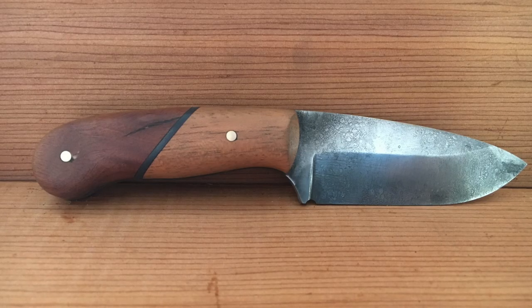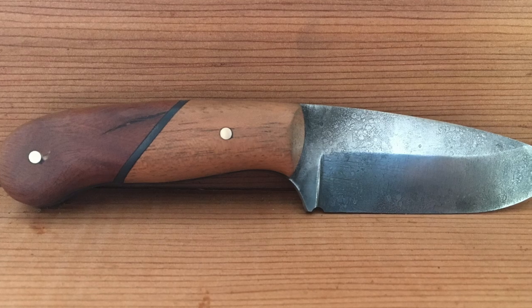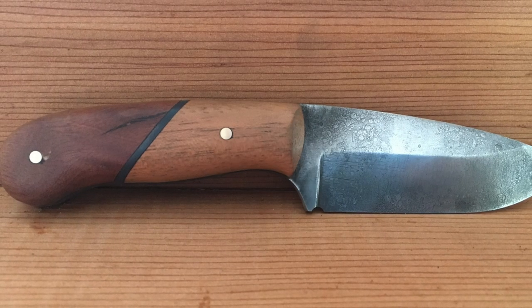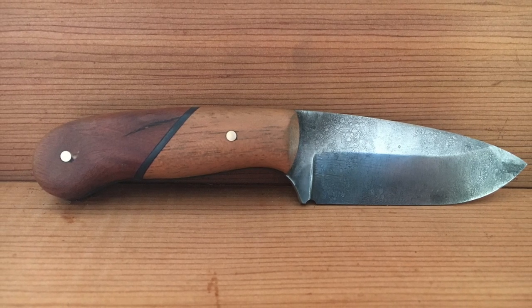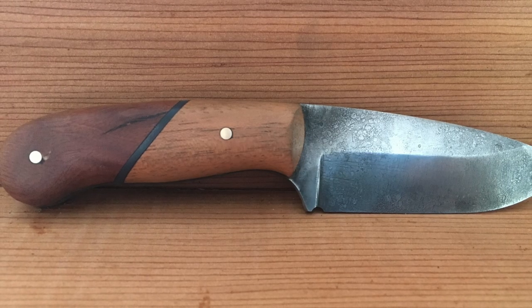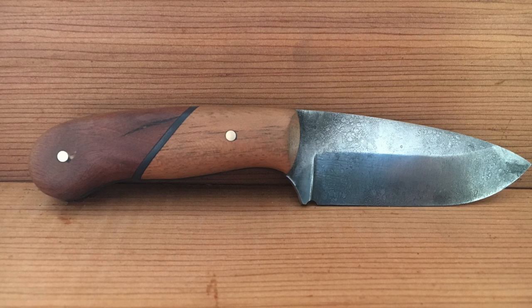We're going all the way to Australia. Ethan is a 16-year-old knife maker and he made this knife for his cousin for her birthday — that is really, really cool to see, and I'm sure she was just thrilled to get this. The steel he used was a recycled saw blade and he used the file jig method, just kicking it old school, working away at the bevels. The pins are three millimeter brass rod, and the scales are some timber and a couple of bits of plastic he found in the garbage. The darker wood is Darta and the lighter wood is called sweet mahogany. Either way, this is a great looking knife with a great looking handle, and I like the texturing on the bevels. Keep up the great work, Ethan.